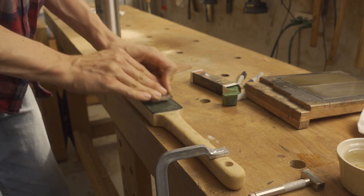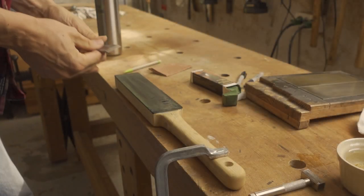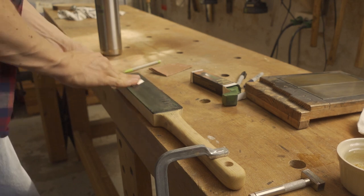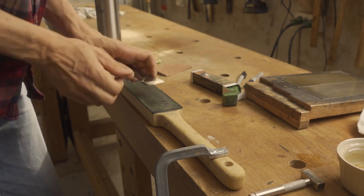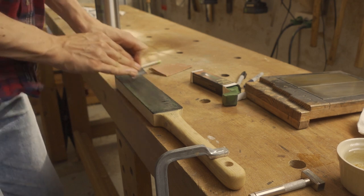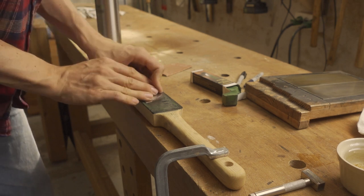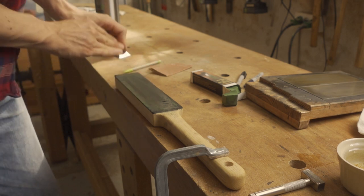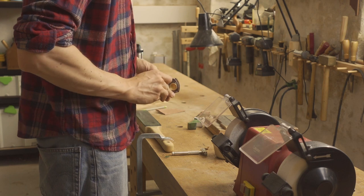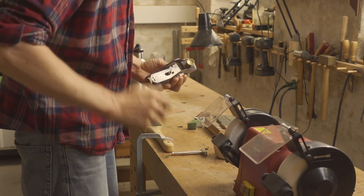Perhaps you've noticed that this is the first time I've touched the back of the tool during this entire sharpening procedure. This may seem odd given that the back of the tool is just as important for creating the polished zero radius cutting edge we're looking for. The reason is that the back of the tool is already polished — there are no big scratch marks from the grinder that need to be removed. So all I need to do with my strop is to turn the hook burr around and perhaps do a few more strokes to maintain the nice shiny polish. Now I'm done sharpening — I've created a zero radius intersection and honed and polished it to make it sharp and strong.